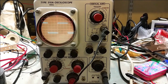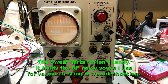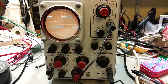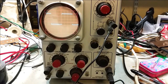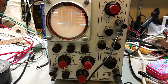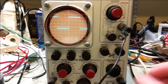This is Jim, W4JBM. I wanted to give an update on the work I've been doing on the Type 310A oscilloscope from Tektronix. I do have a trace now. I found a couple of issues in the time-based section. There was a coupling capacitor that fed the trigger that had gone bad and opened. There's also a pair of neon light bulbs used in the timing circuit — one had been replaced, and it looked like a soldering gun was used that was too hot, making one of the leads brittle. It had broken off up in the glass, which was a little challenging to catch. But I do have a trace now.